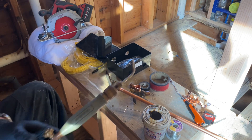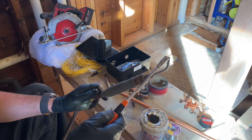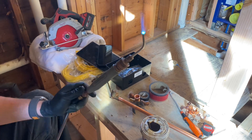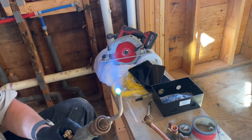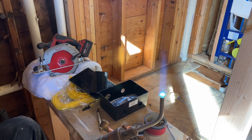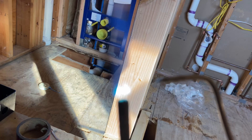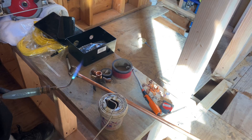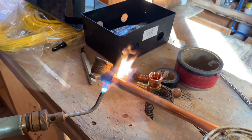Now I have my nice-sized tip for this. I'm going to turn on the gas and light it. Take a look at the flame — we go all the way up here, which you may not see on camera, but this is hot. Right here though, this is not the optimal heating temperature. You want the pipe right there — there's a cone of blue, and that's where you want to heat the fitting.